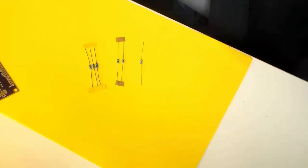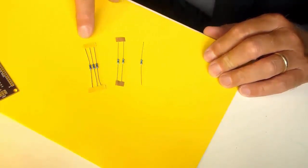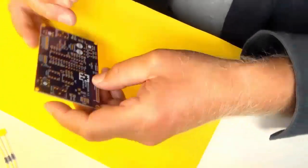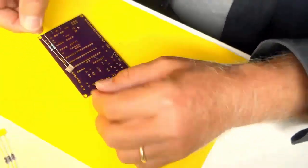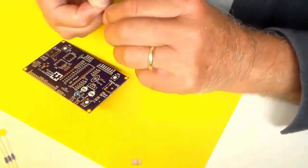We'll start with the resistors. We have one 1000 ohm resistor, two 470 ohms, and three 150 ohm resistors. Our 1000 ohm is a pull-up resistor — it holds pin one of our microcontroller high so it doesn't reset unless we want it to when we push a button. These two 470 ohm resistors are current limiting resistors for our LEDs.